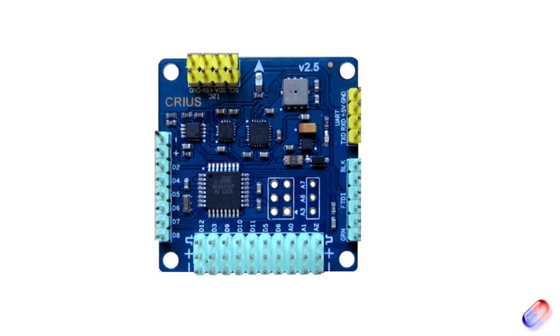Moving round at the two o'clock position we have the UART. The UART is there to connect to things like anything really that has a receive/transmit and needs five volt and ground on it. Further round you've got the FTDI connector — that's the one we will use for things like programming. You need the FTDI board to plug that into, and on these you always make sure the polarity is right. You can see what it says: black and green, which normally means the FTDI board is pointing out to the side when connected properly.